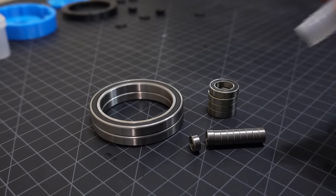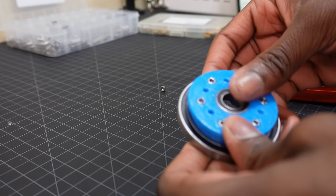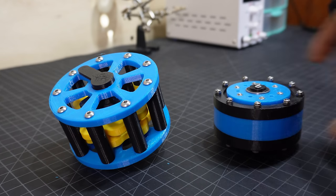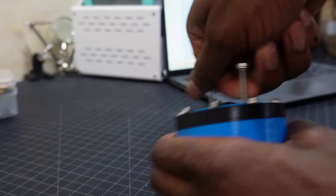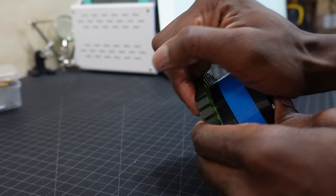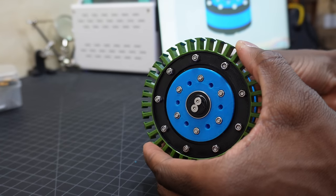The main goal was figuring out the smallest screws, bearings, and spacers that I could use without compromising the actuator's strength. I genuinely spent weeks getting the design to this point, but once everything was built, it worked pretty well. I'm also glad to see that it's back drivable, which was one of my main concerns with the design. As planned, it fits right into the center of the stator. Now that I know that the gearbox works, it's time to get some parts machined for the final actuator.